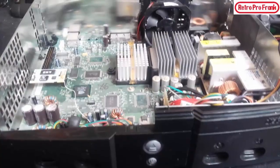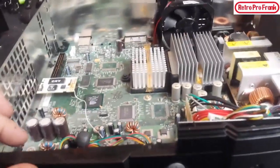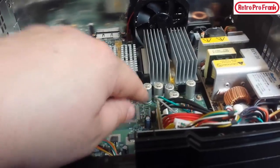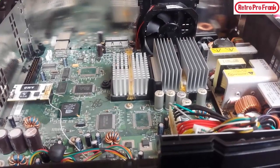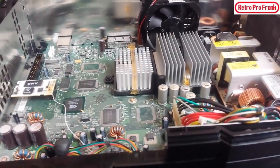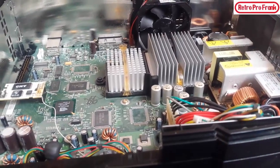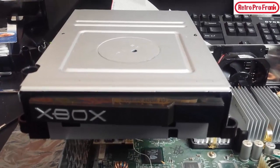So we've already learned quite a bit about the original Xbox. You can tell the version by the power supply connector — single pin means version 1.0 or 1.1. Before I researched this I really thought this was a version 1.0, which is pretty much what everyone wants — it has one of the best hard drives and CD-ROMs. But this is actually a version 1.1.